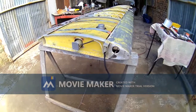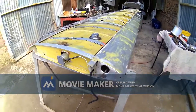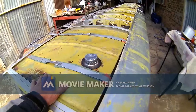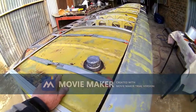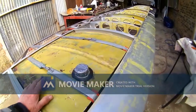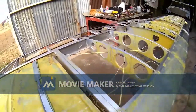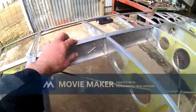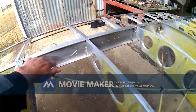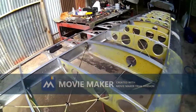Okay, so this is the 1947 Luscombe wing that we rebuilt. Fuel tank, you can see it looks 77 years old. It's been acid washed and lined on the inside with EC776. All the fittings repaired. We had the whole rear spar off. We had a bit of corrosion in places. Polished the corrosion out. Basically rebuilt the thing from scratch.